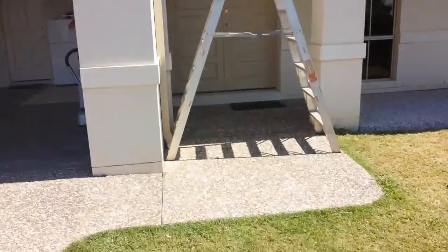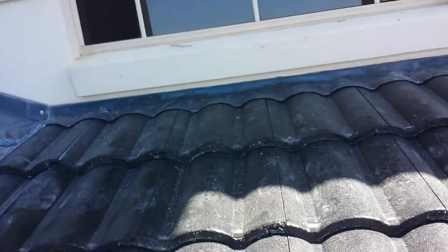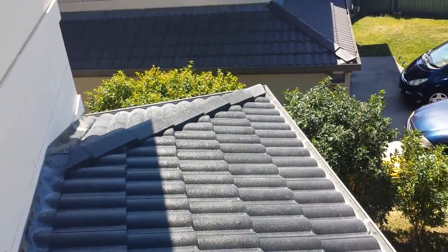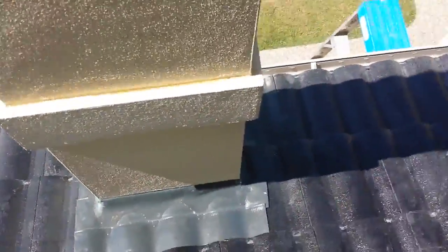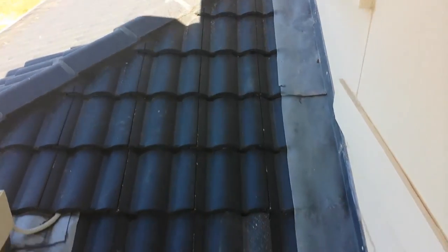I'll just take a little top view once I've got the ladder set up. You can see how nice everything is working — we've got our flashing cut in against the brickwork and that just wraps on top of the tiles there. You can see the roof, we've just hosed it down to check for any leaks. We have put the hip ridge line in, and that's got a special mortar to set that in nicely. We've had to put flashing around the existing pier, and that's how we've just transformed the roof flowing straight on to our new roof into the gutter.